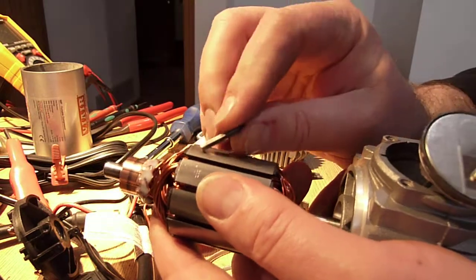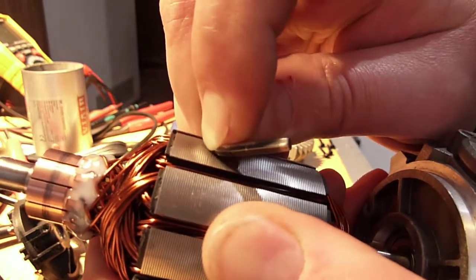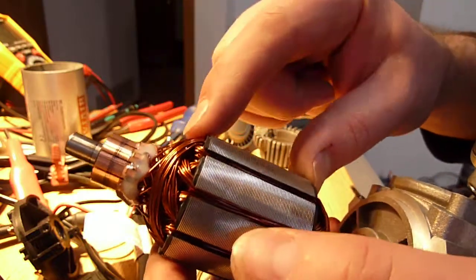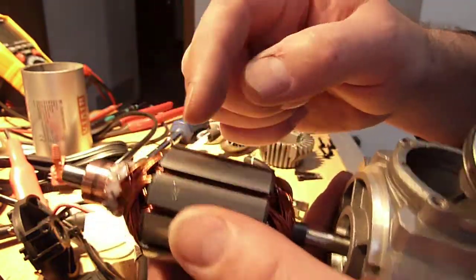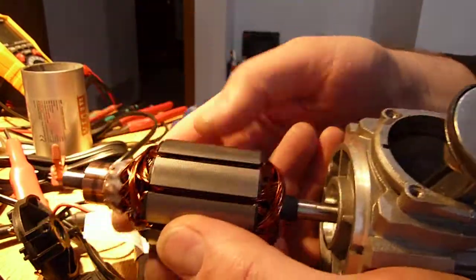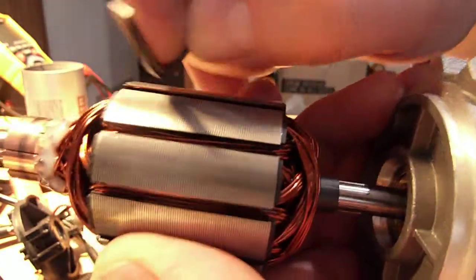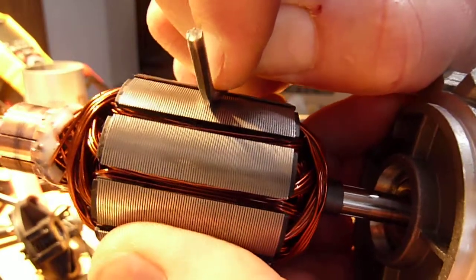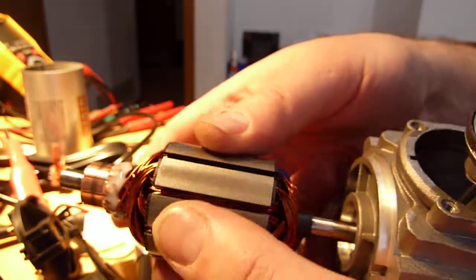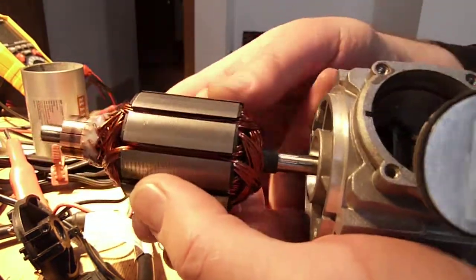Sometimes you'll find that the laminations come apart a little bit — so they are not glued together, they are just compression fit together. If you were to take all these windings off you could separate all the laminations, but they're trapped so they can't really go anywhere. You can definitely see the little tiny gap that forms in there because they're not glued together — just bare steel with insulating material on either side of them, but no glue. Still, that's not horrible — I've seen far worse.